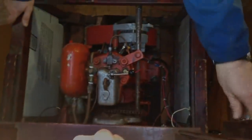It's amazing that the engine started up like this after 3 years of sitting at the dock. However, just shortly after that video cuts off, a whole bunch of water started gushing from the back of the engine and we had to quickly shut it off. The culprit seemed to be a rubber frost plug installed on the back of the cylinder. A frost plug is there in case the water inside an engine freezes. To prevent the cylinder from exploding, the expanding water instead pushes out the frost plug.